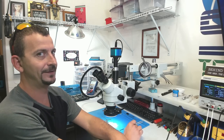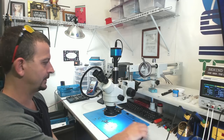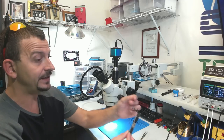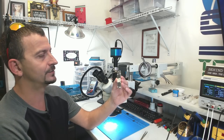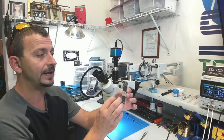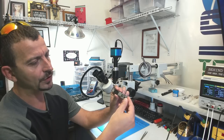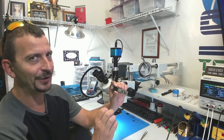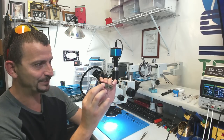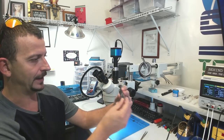As it turns out, this board is actually significantly bad. One of my main concerns with this board is that this has the A9 CPU on it, and the A9 CPU is really, really sensitive to having the RAM damaged by heat. If this board was heated hot enough to just smear everything all over the place, I'm wondering how hot the rest of it got.